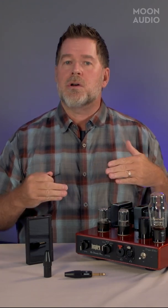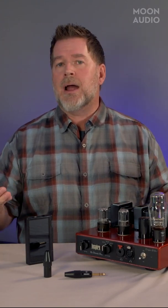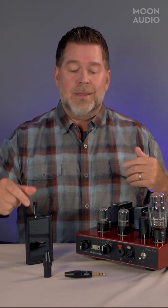This isn't good for your internal amplifier. It doesn't like to see this crosstalk between channels and grounds. You're basically going to shunt a channel to ground or something like that, and it's just not good for your device. So this is a real simple thing, but it's a very important thing.